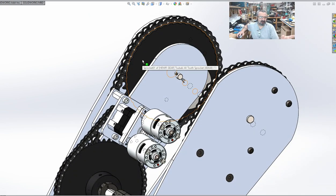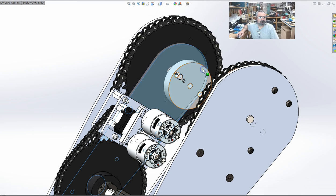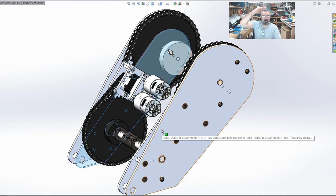And then from that 8-tooth sprocket, we go into a 44-tooth Tsubaki sprocket here. That keys into our eccentric drive, which is our eccentric lobe, which is right here. And if my math has been correct and worked out, it should be able to go from full down to full up in 4 seconds or less.